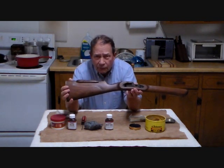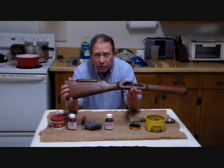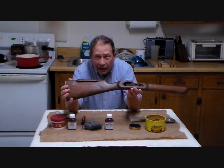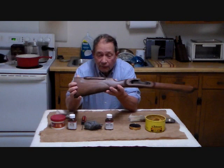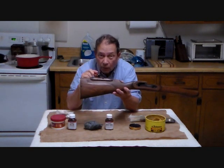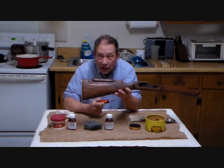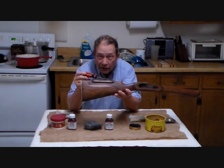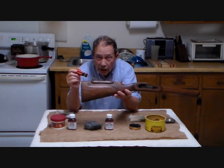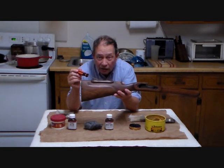We wanted to make it look somewhat better, and we also wanted to adjust the point of aim of the shot, as well as the impact point of the ball. At first, we taped up some cardboard and some other material to build up the comb here about a quarter of an inch. Then we shaped a piece of wood, pegged it in, cut it down, shot it in, and have now shaped it and refinished the entire stock.